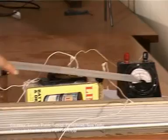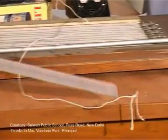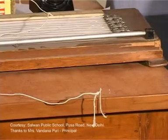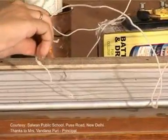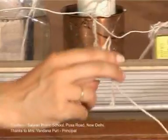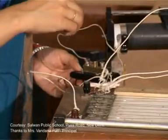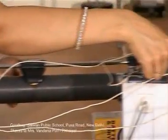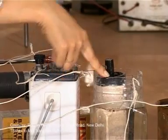In order to obtain the null deflection, we will be using this galvanometer. The other end of the galvanometer, seen as a free wire, will be used to make a connection of the jockey with any of the wires of the potentiometer. Now let us take the very first reading. We include the driver cell E in the circuit, and then include cell E1, the Leclanche cell, using the first connection of the two-way key.